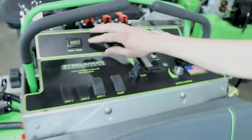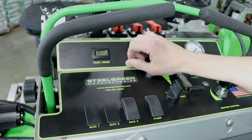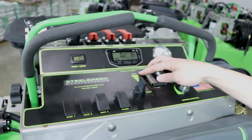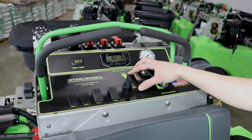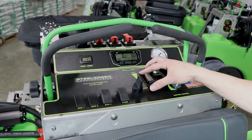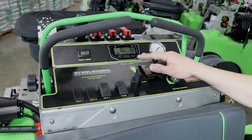On the left of the speedometer is your tach/hour meter. You'll utilize this for maintenance intervals and to monitor your engine speed. You always want to make sure when you run this equipment, it's best to run it at the top end of the RPM. Running at full throttle means the engine charges the battery as well as it can, and also cools the engine best because there's a fan on top pulling air through while it runs. Running it at mid-throttle is not a good thing.